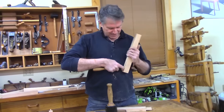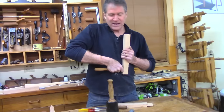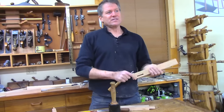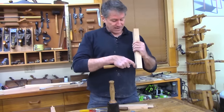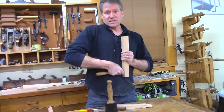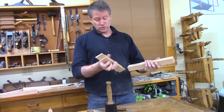And that's one of the points they made in the article that I didn't even think to make, was that in making a bed like that, that low pencil post bed is what the article's going to be about, there's three different types of ways of cutting mortises and tenons on that bed. You have the long rails that are stout, you have these smaller ones like this, and then you have the actual tenon for the headboard that has no shoulder.